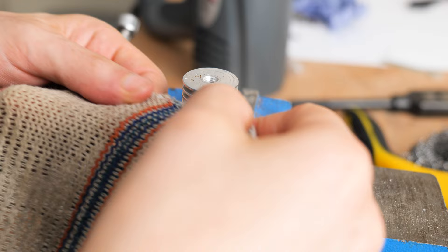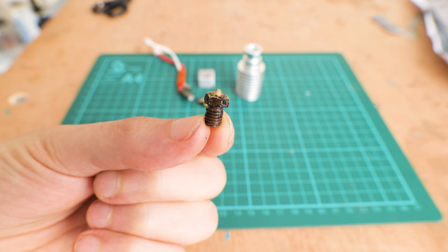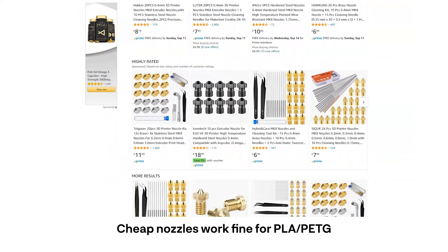Next I just removed some dust from the heat sink with a wet cloth. It's important to keep this clean because you want the metal to not have any insulation on it - the whole idea of this heat sink is to dissipate heat out into the atmosphere. I tried to clean up the nozzle but it was just the same case as the heat block where after a while you're just smearing it around, and I was unable to clean it up unfortunately. Nozzles and Bowden tubes should really be seen as consumables with 3D printing, so I've decided to replace it with a new brass nozzle.